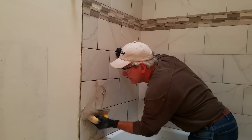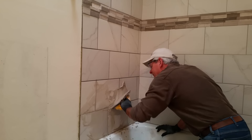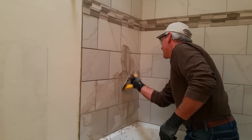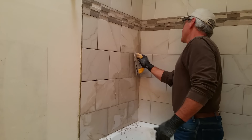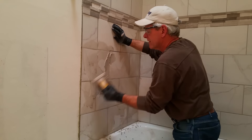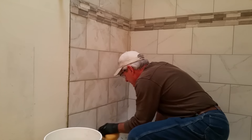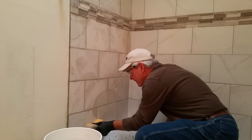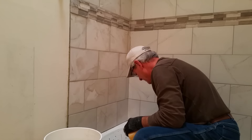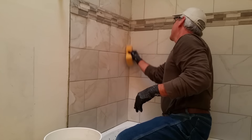Grouting is not one of my favorite parts of the job, although it is one of the most important. You mix grout to allow it to be easily worked into the joints — in most cases that's about the consistency of a half-melted bowl of ice cream, which is a pretty good place to start. Different types of tile will soak up the moisture in the grout at different speeds, so you need to experiment a little with your tile to get the mixture that works best. About five minutes after grouting an area, come back and wash down the joints to see that the grout is beginning to firm up. If it's still a little runny, add more dry grout to your mixture to thicken it. Keep floating in grout and washing down the joints until you get the look you want.